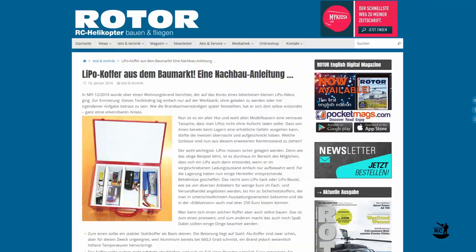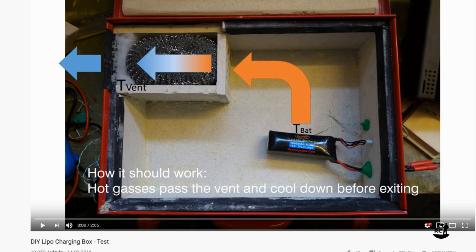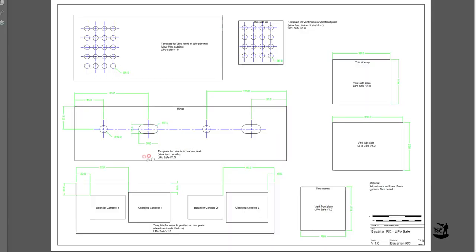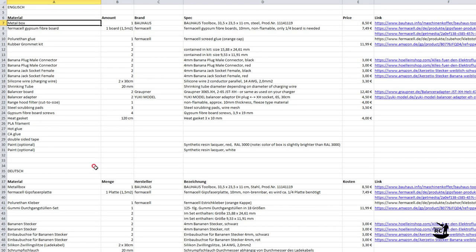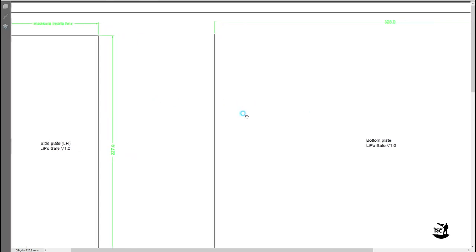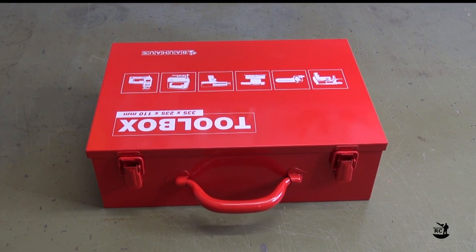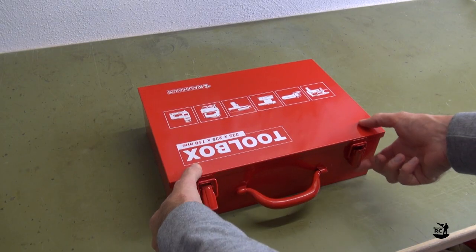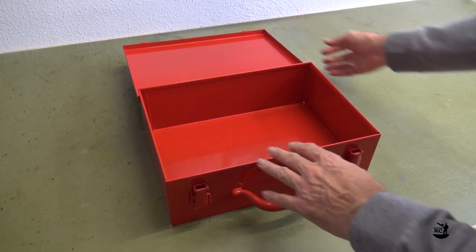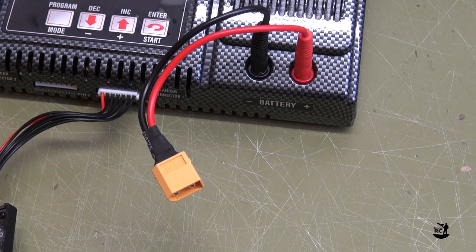The design of my LiPoSafe is based on several ideas I found on the Internet and YouTube, including some detailed solutions designed by myself. You will find the links in the description below. I will also put a link to the free plans, my STL files, and a material list in the description. The dimensions of the Fermacell board on my plans fit the specific metal box I used and might need to be adjusted depending on the box you use. Even if you use the same box, you might need to slightly adjust the dimensions, as the boxes have some tolerances. Also, the connector types might be different for your specific charger and batteries.